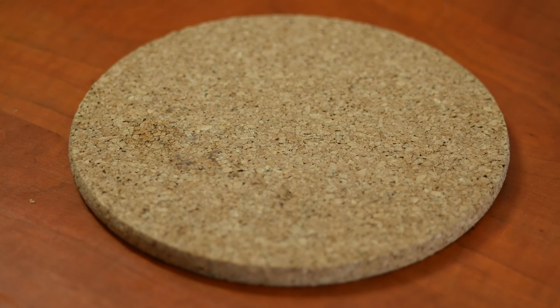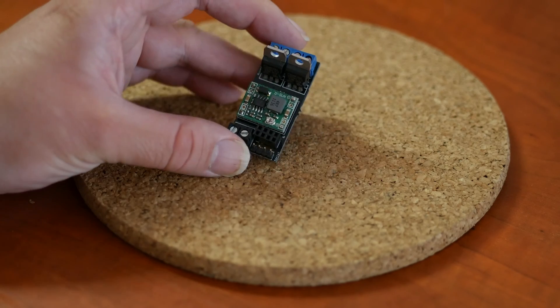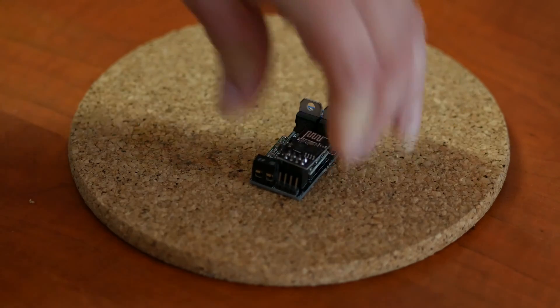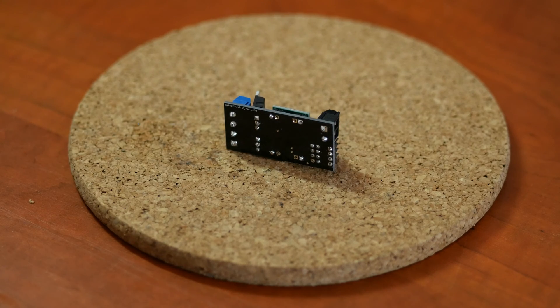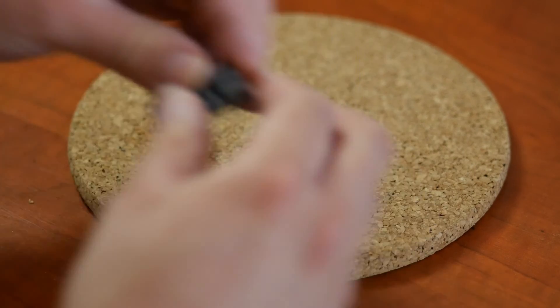Version 2 quickly followed. The previous board was 5 cm by 5 cm; this one is 2.4 cm by 5 cm — less than half the size with the same functionality. I found a much smaller voltage converter which enabled this, and moved the MOSFETs closer together. We keep the socket for the ESP8266 and now have a very compact little board. The reason I wanted to do this is I wanted to be able to put it into wall sockets, but there was some stuff I still wanted to change.